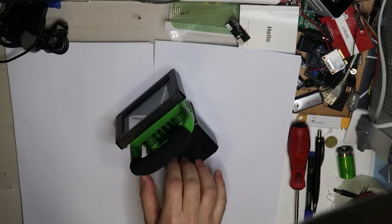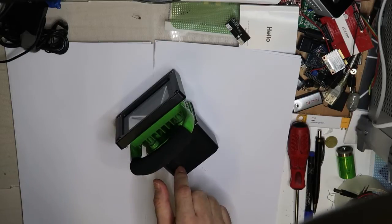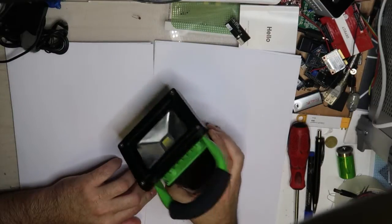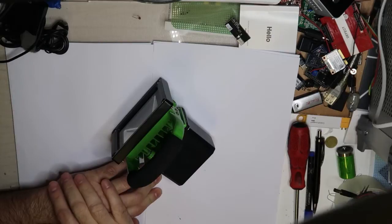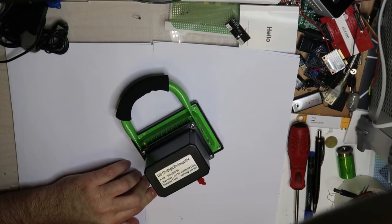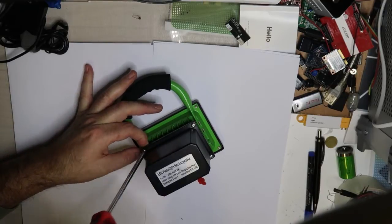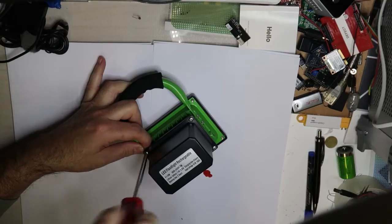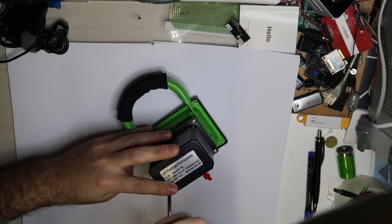The second way is to put protection control in your power supply, and the third is an internal circuit in the battery itself — done by many manufacturers — called a protection circuit. If you buy a cell and see a metal strip running from top to bottom, it's a protected cell. So you have three ways. Let's open this up and maybe I will be surprised; this is the first time I'm opening it. It is also protected against rain and humidity for outdoor use.